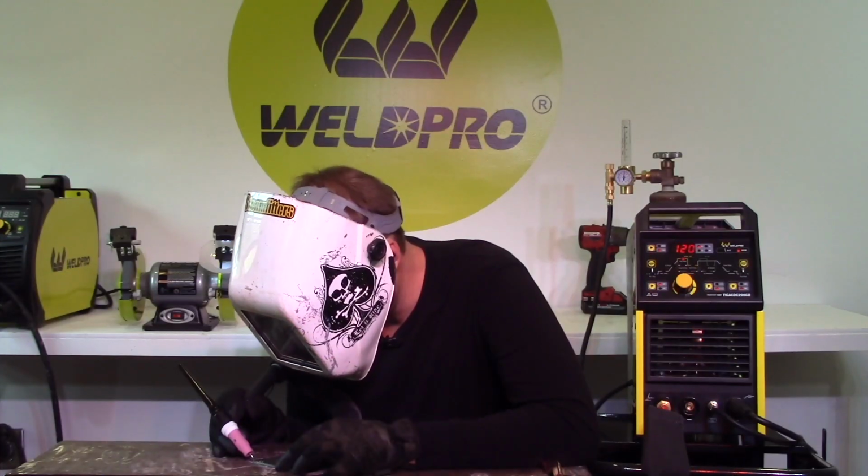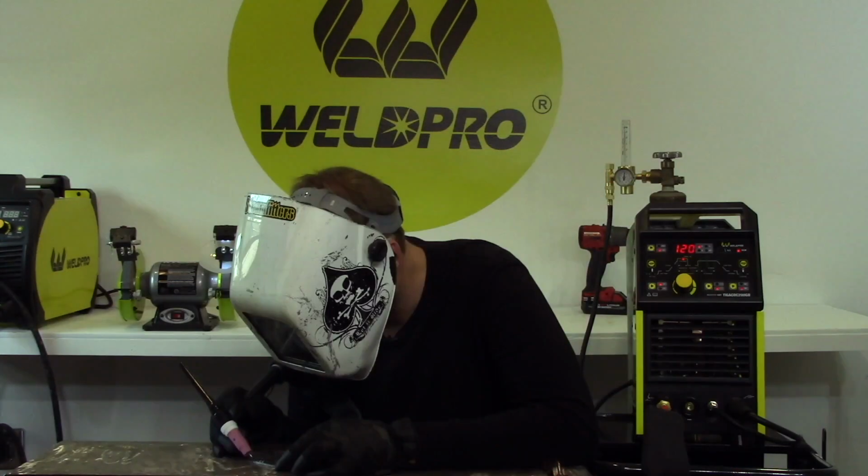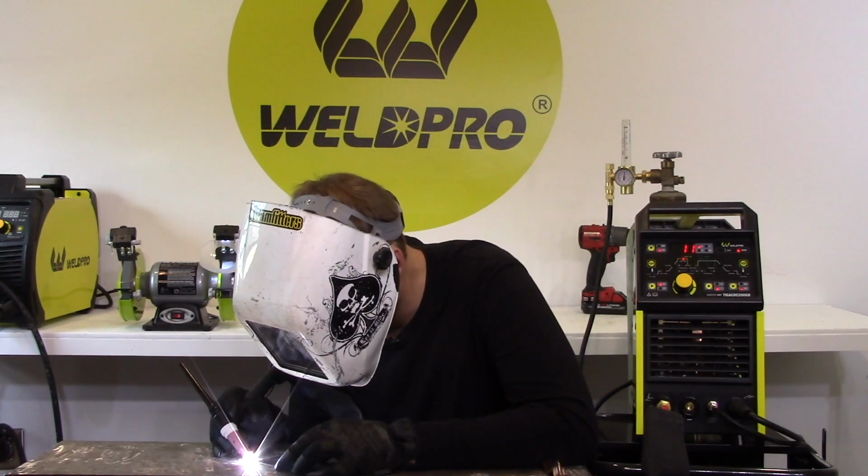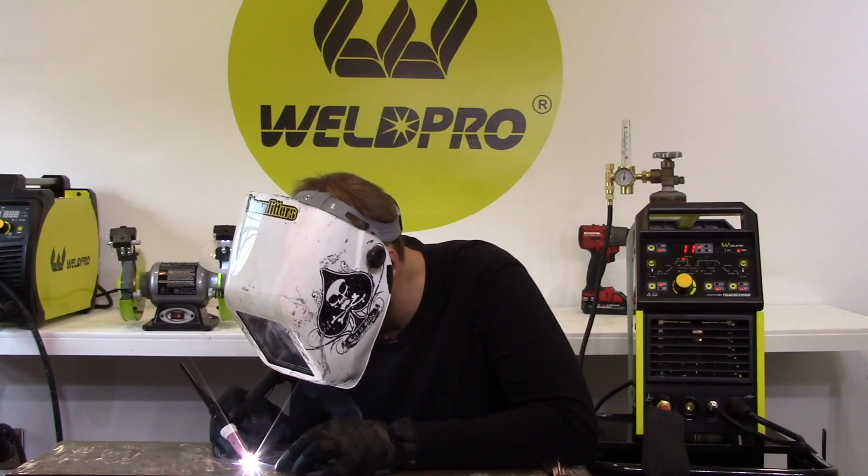I'm going to go ahead and push down on my foot pedal to establish my high frequency start. Okay, with the pedal slightly depressed, we're probably running about 5 amps. Let's increase that ever so slowly until we see our plate begin to melt.